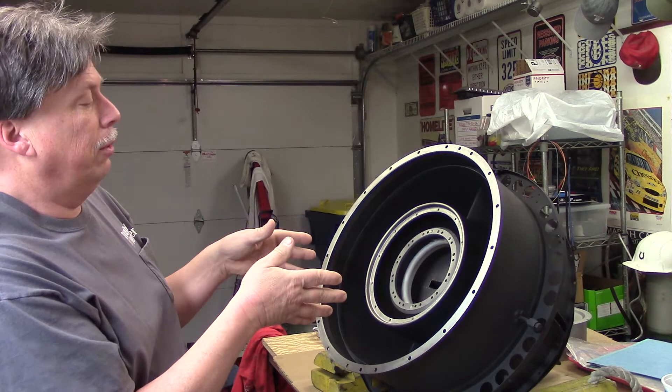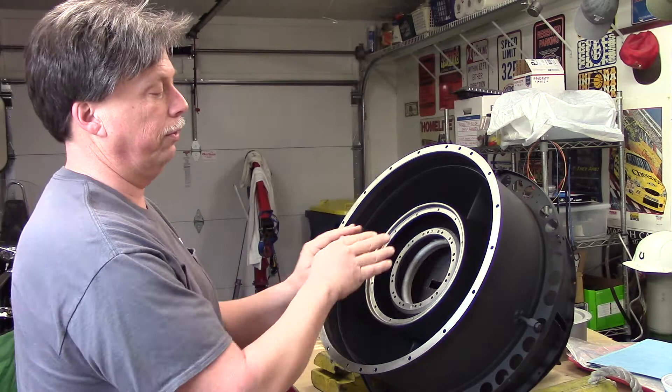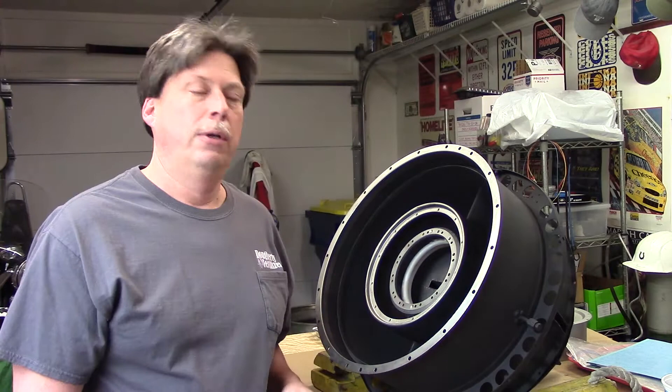You also have cooling air coming down along the rotor shaft assembly inside the combustion chamber inner liner. That air comes out and strikes the front of the turbine disc, spreading out to cool the disc from the front. These next several videos will cover reassembly of this, getting it back together and ready to set back onto the engine assembly.